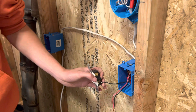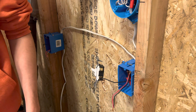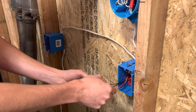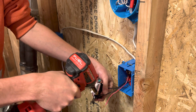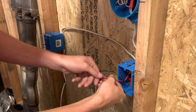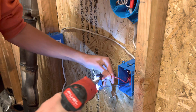And then you're going to have to troubleshoot that later, which is probably going to be in the next video. So black goes to black, and then the other black traveler I usually like to put on the other side just so I'm not confusing them. I like to do the common first, but just to keep things simpler I like to put the black on the other side — that's just my personal style. But feel free to put both blacks on the same side if you wish. So I'm going to go ahead and put this red in next.